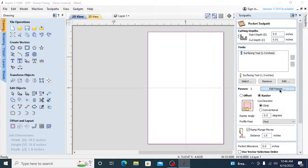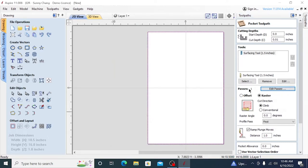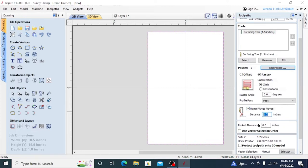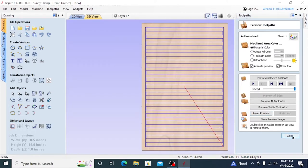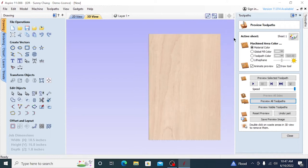Select a surfacing bit for your tool. If you don't have that, a flathead end mill will also work — it'll just take longer to cover the surface, but you can handle a deeper pass depth. Check the box that includes a profile pass and select whether you want it first or last; this just cleans up the edges of your cut. Include a pocket allowance of minus 0.25 inches so the bit will extend just beyond the material border so that the round bit can cover the corner. Give your toolpath a suitable name, click calculate, and make sure to preview your toolpath to confirm all of your surface is covered. If something looks off, check that your offset is a proper amount for your material size and bit dimension.